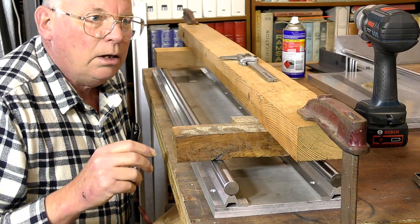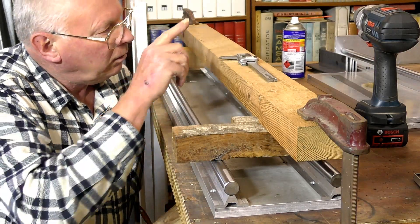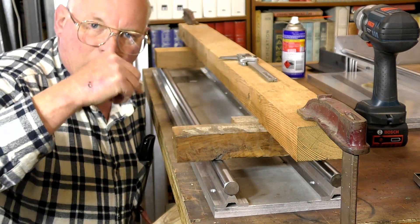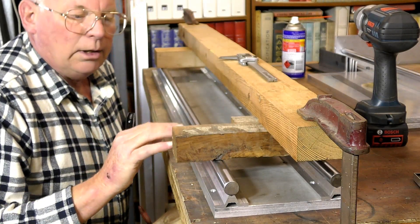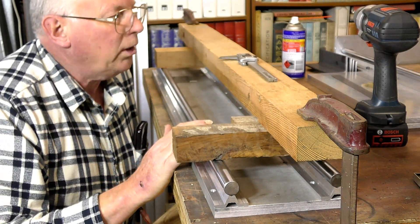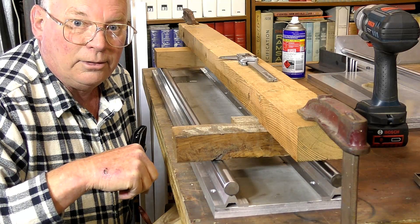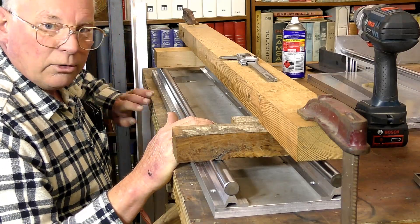The holes that are drilled in the linear rail are about a quarter of an inch, which is around about six millimeters. So I've got a six millimeter drill, and I'm just going to put it into each hole and just put a mark — an indentation — in for about a millimeter or so. Then when I remove all this I'm left with the drill marks, so I can drill the correct drilling size to thread it, which in this case is five millimeters. So that's my next job.